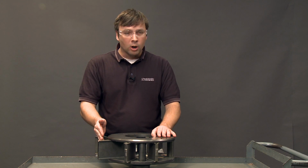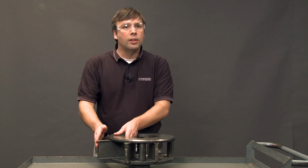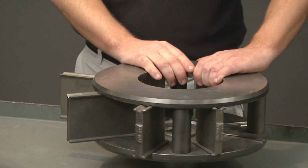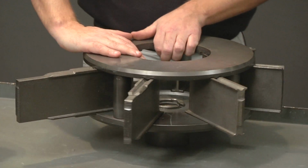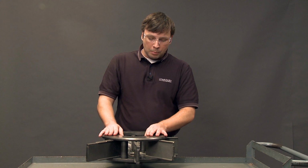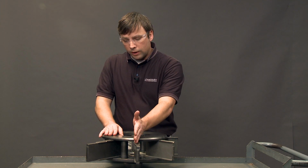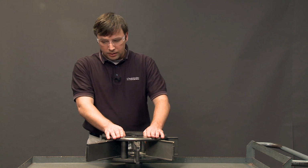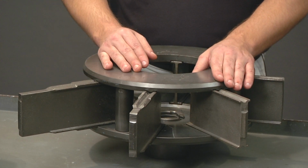For instance, if there's burn-in sand, you may want to try the 16-inch blade or the 18-inch blade to hammer that casting and knock loose the sand and scale. In a structural descaling application, we would go with a low-speed motor, 1800 RPM, and a 20-inch, 24-inch, or 26-inch diameter blade, again varying in different velocities and different wheel flows.